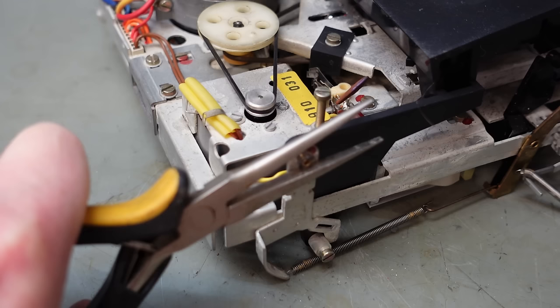That means I don't have to open this up very much at all. I shall just hand ream it. I know it's not a reamer, but closest thing I've got. That's 3.5 mil. She's 0.05 mil short, but we'll see if I can get this bush to squeeze in. Looks pretty good.